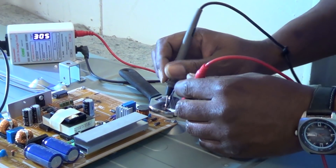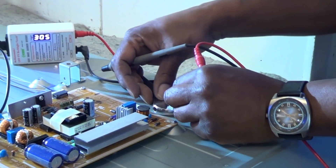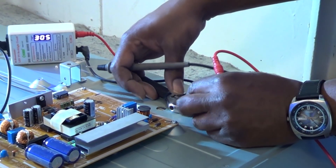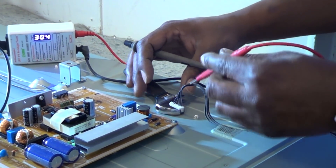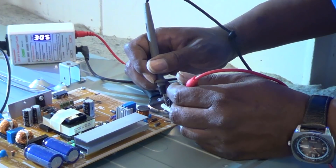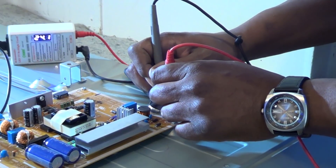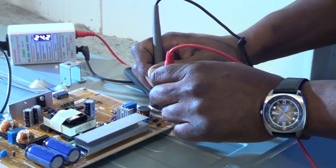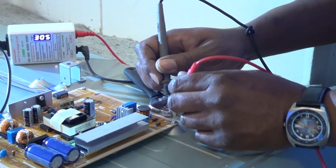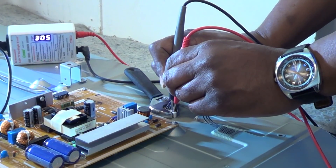The second set is right next to it — black to negative, positive to gray — that's another one showing up, and I can also see some LEDs lit on the TV at 22 volts. Then this last one here: positive on the gray, negative on the black — as you can see it is reading 305 and it is open. So the third LED strip is the bad one.